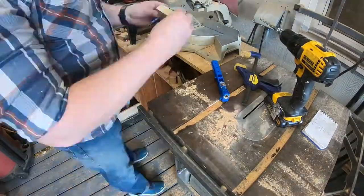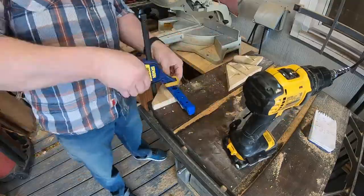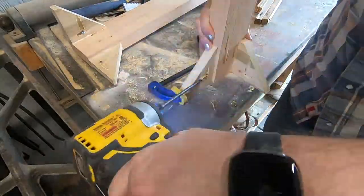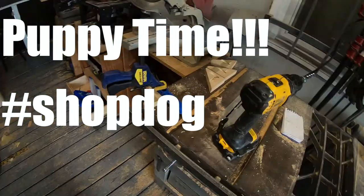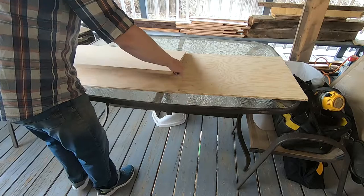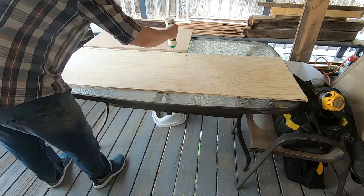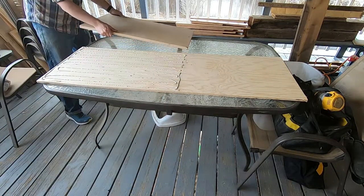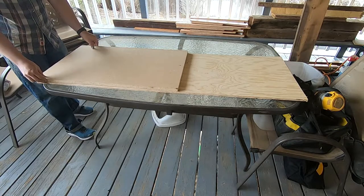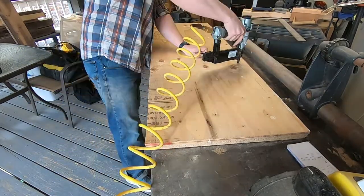To attach the legs to the desktop I'm going for the internet's favorite guilty pleasure: pocket holes. It seems like every YouTube woodworker has to pick team pocket holes or team joinery, but since this is essentially shop furniture I wasn't going to bother cutting a mortise and tenon. I set the MDF on top of the plywood so I could mark where to apply the wood glue — I didn't want too much glue going over on top of the cabinet. Then I poured on a generous serving of wood glue, placed the MDF back on top of the plywood, and made sure they were relatively lined up. The wood glue will be more than strong enough, but I wanted to put a few brad nails in place to keep the pieces from sliding while the glue dried.